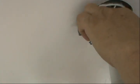All right, and once everything is connected, we're just gonna stick it inside the wire box. All right, we'll finish the connections. It's done. Is that how simple it is? So the connection is this: blue and black together, with the black coming from the power, and then the white with white and green with green. Okay, guys? So let's continue.